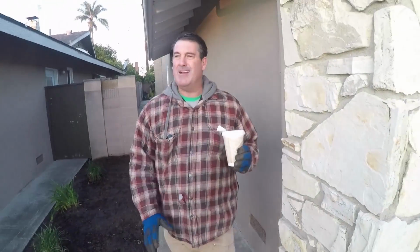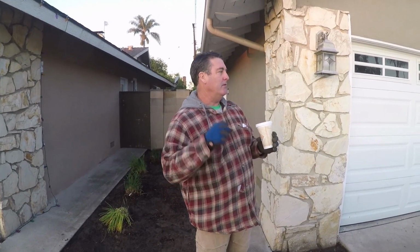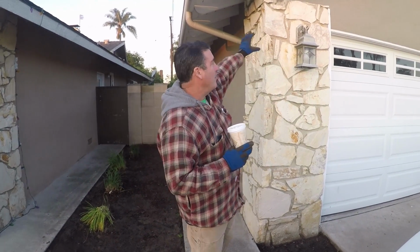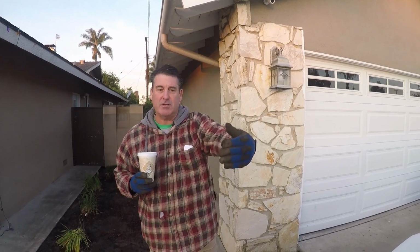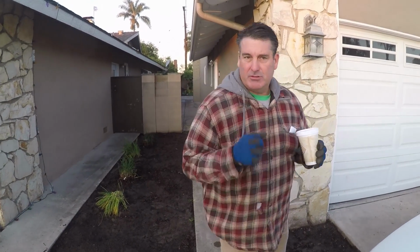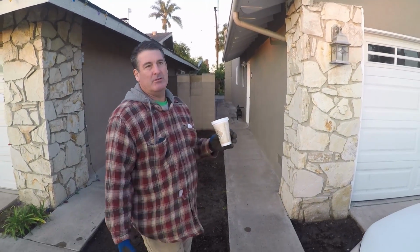Right now we're in the rainy season, so I'm not going to open this driveway up until we get a good clear 2 weeks in the forecast. Once you open something like this up, and all the runoff from the entire property is hitting here, it can't run over the sidewalk because now you're low, so it becomes a real mud hole. So we're looking for a couple of good solid weeks with no rain in the forecast, so we can blow it out and get it back in between storm systems.